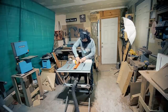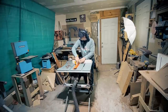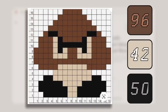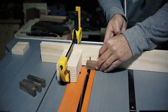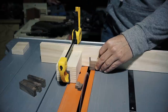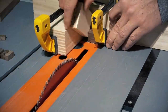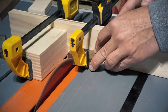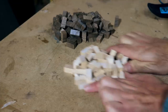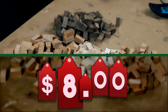This'll take you a few hours — it took me about two hours, and that's with the benefit of having gone through this several times. Put on a podcast or something. By the way, I know how many pixels I need because I went ahead and counted this grid. I'll color code each row of pixels and then just add it all up. I wouldn't blame you if you're a little queasy at the sight of my hands this close to the blade — there's a better way. Put the strips up against the spacer and clamp them down. This will give you a better quality cut too, because you can ensure there's no slippage. You can also cut through more strips at once — getting three pixels instead of two really adds up. And that's only about $8 worth of wood.